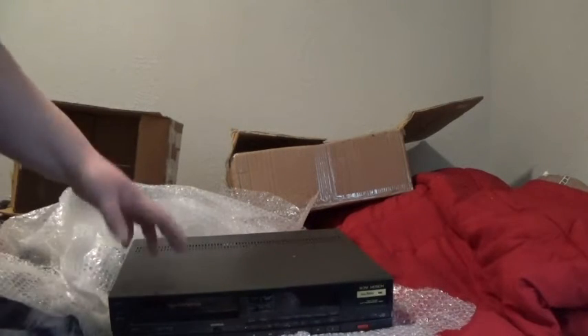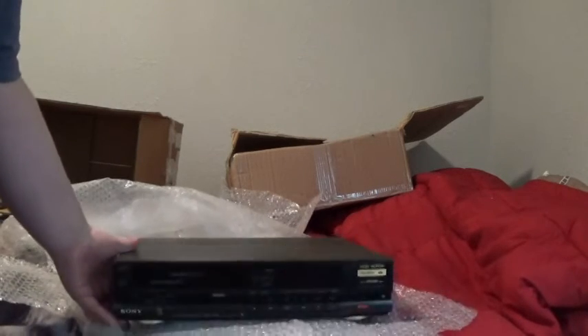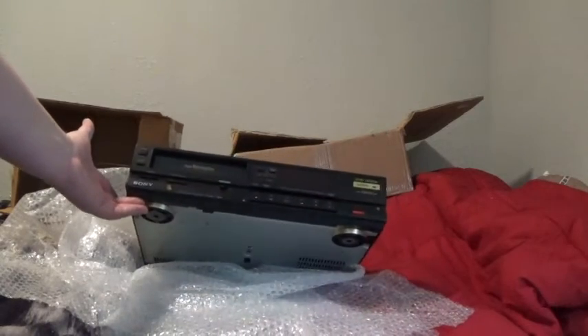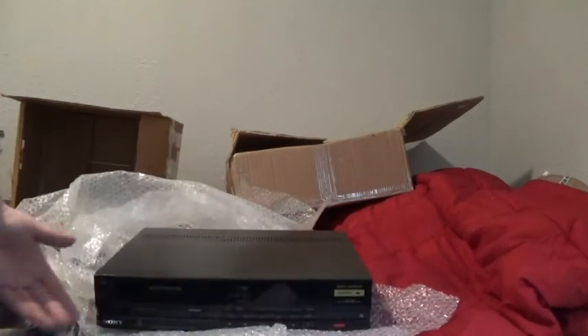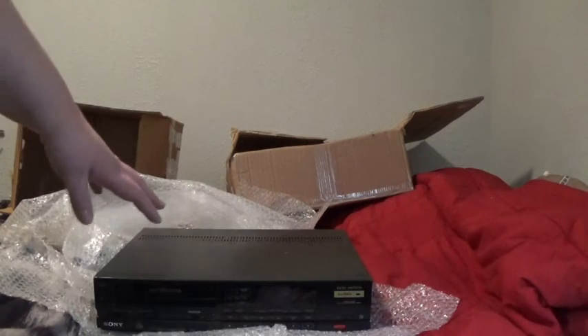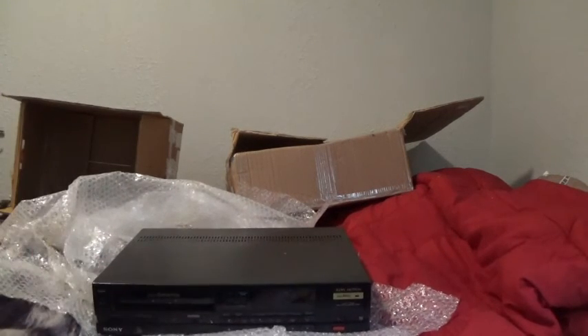For right now, that's all we've got. I will do a video — we're going to put a power plug in it, then power it up and go from there. I've had several of these and I've liked them. The surface-mounted electrolytic capacitor is kind of a pain to get off, but once you get that bad surface-mounted cap off, you can solder a new cap in and it'll work. If it has an issue — which I think it does — we'll show you how to fix that. Because if you have this model and you're having symptoms like it won't fast forward, it won't rewind, or it won't play — that's the symptom. That's what we're going to show you how to fix in the next video.